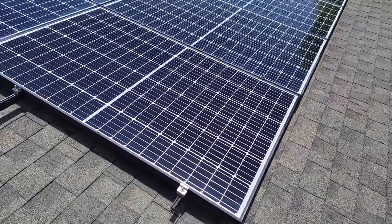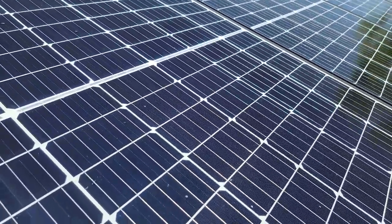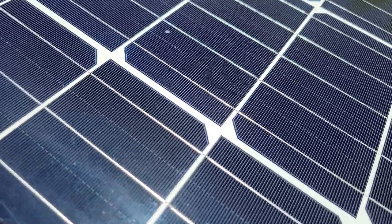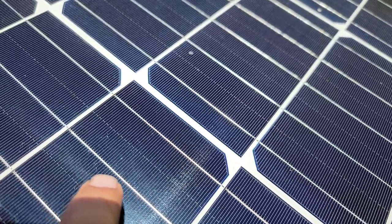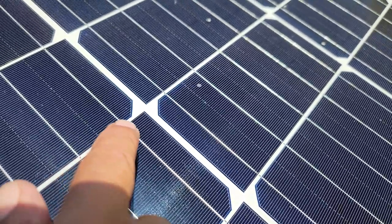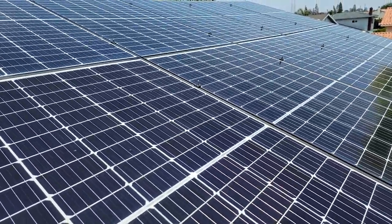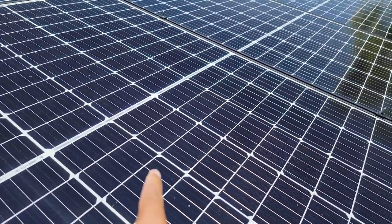Some of you purchased your solar panels. The reason why you don't want to use soaps is because when you use a soap or a detergent, it's this right here. Inside, as you can see, these are nice and clean. But if you use any soaps or chemicals, this will start to fade out. It will burn out. And once it burns out, that's it — your panel is pretty much done, or that cell is pretty much done.